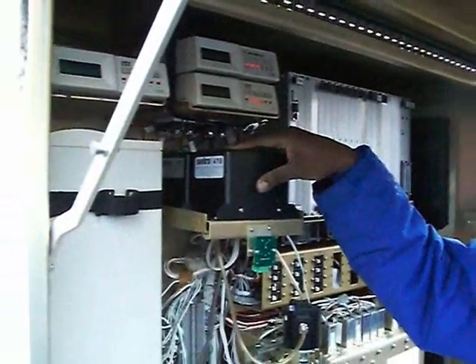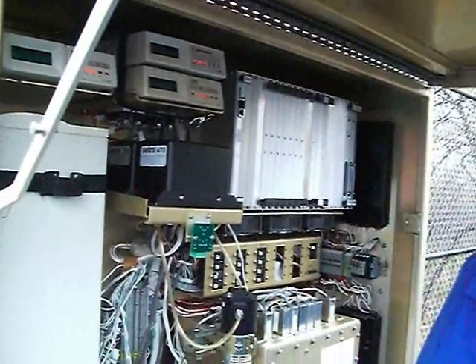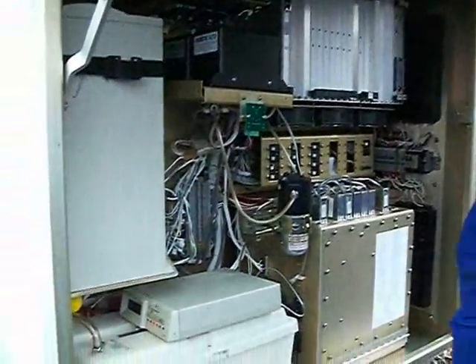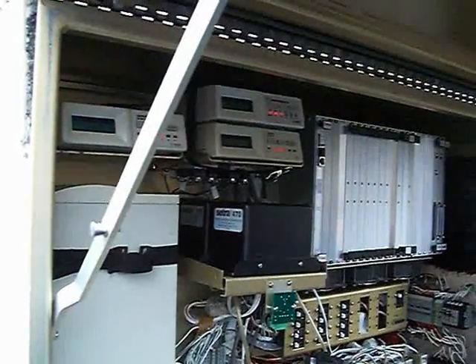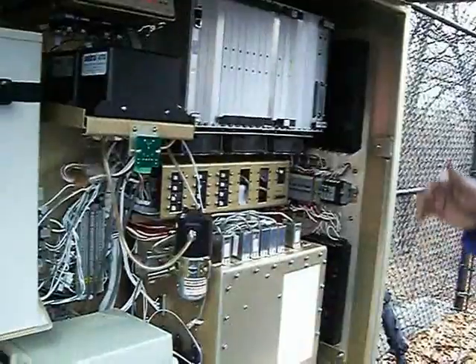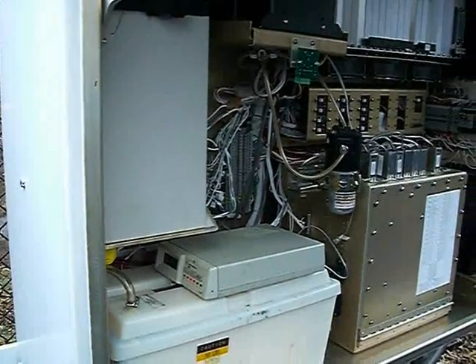We also have an analog-to-digital conversion system. This sensor here is the altimeter, used through avionics — planes need to know the pressure to land, so it's very important. This sensor is inside because if there's a loss of power outside to any of the sensors, they go offline, but this is internal and can still work for at least an hour thanks to a backup battery supply. At certain major airport sites, systems are connected to generators so they can run for several hours. Here we have the modems — that's how we talk to the system remotely from our office and dial out observations. We have breaker switches for each individual sensor, and backup power supplies as part of the UPS system. Any questions?